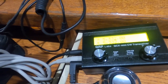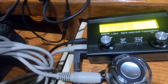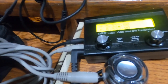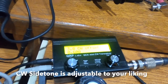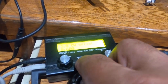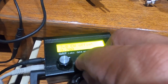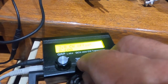From the picture in the manual, it looks like they've set the default so that VFO A is the receive VFO and the transmit VFO is VFO B. CW offset is menu item 3.8 and it can be changed by pressing and adjusting it to your liking. Since I like 600 Hertz, that's what I'll set it at.